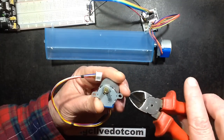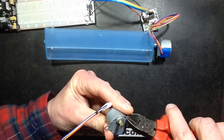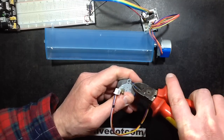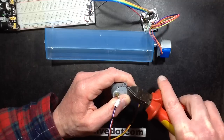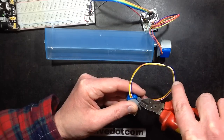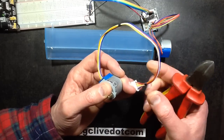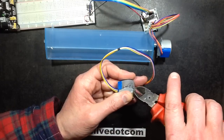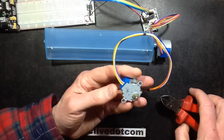I'm going to use my electrician's snips to prise it open — not really what you'd normally use, and not great for an expensive tool, but it happens to do the job. The construction of the motor is such that the sides of the case are pinched in to hold the end plate in. I should mention that the stepper motor has basically a common wire and then four coil wires, and by sequencing them one, two, three, four you can make it rotate.